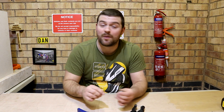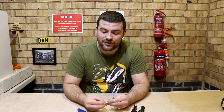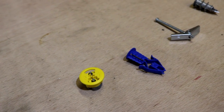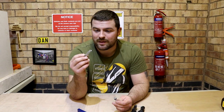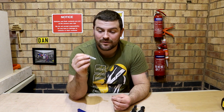This particular fixing is my preferred fixing on site just because it gives a nice sturdy finish once it's anchored behind the wall. There are various other fixings you can use such as a toggle, but in my opinion they just aren't quite reliable enough. These little bad boys, once they're anchored behind the wall, you can remove the bolt, put whatever you want back up, replace the shell fixing whatever it is, and not worry about it falling behind or losing it. Once it's fixed it's fixed, and I found that on site these are my go-to fixing.